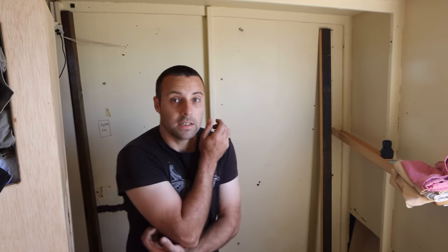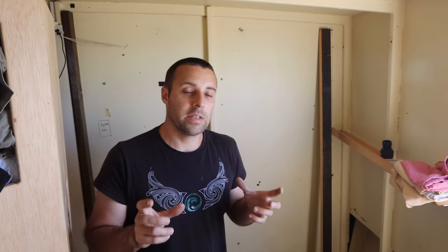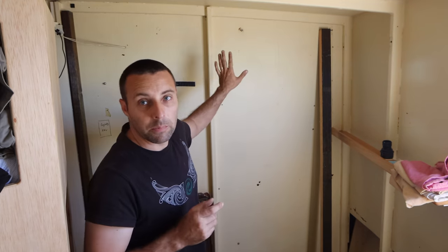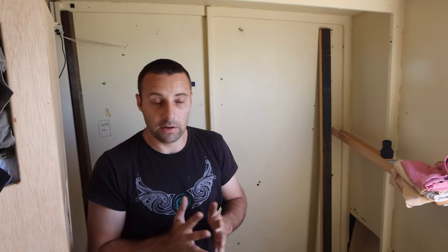So these beams here are 60mm battens that we've epoxied and we glue them into the walls on Brupeg. We use 60mm battens because that's the thickness of our insulation. By putting these guys in, we're able to just put panels of polystyrene insulation in against the wall. It goes nice and tight against the steelwork, and then we can put a wall panel straight over top. It's a real simple and easy way for us to join all of our interior.